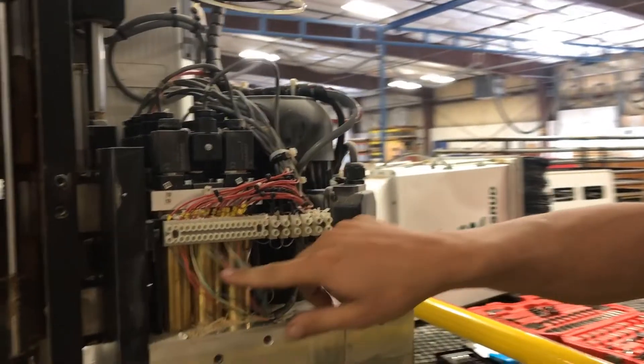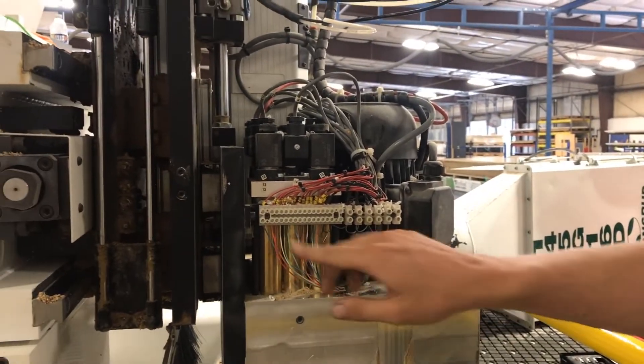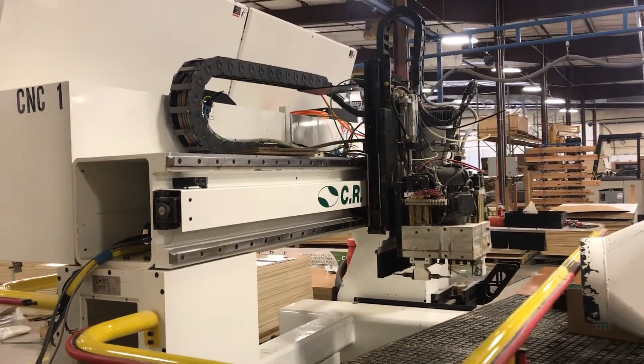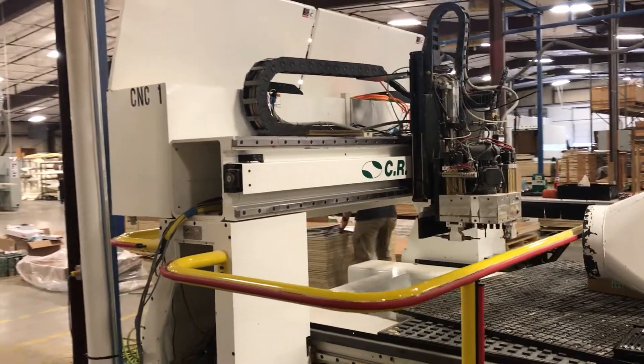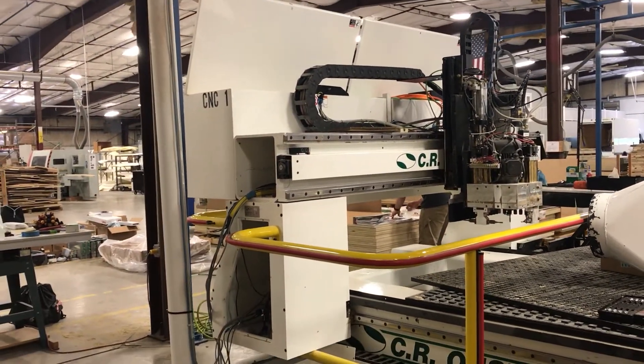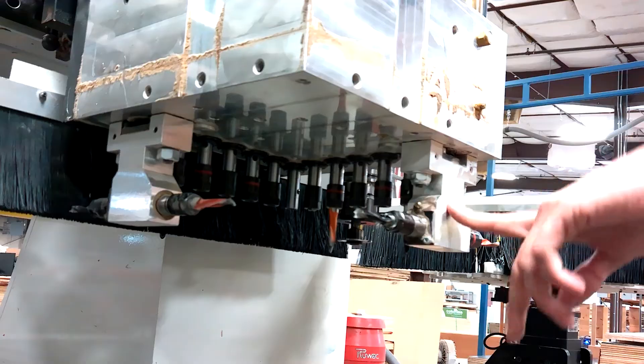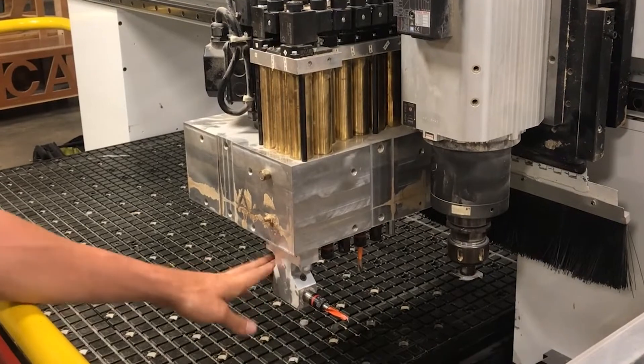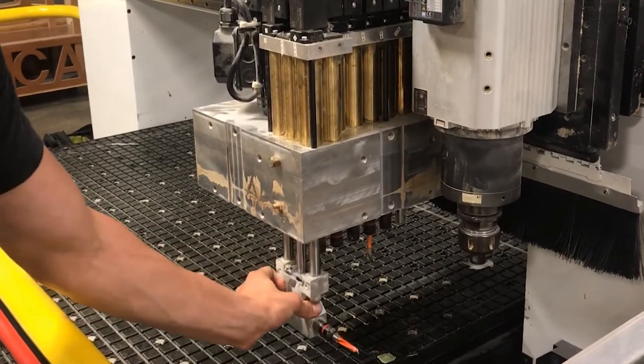We then adapt and identify all the I/O that we're going to reuse. In this case we've reused everything — backing pressure sensors, the emergency stop bumpers on this machine, so any collision will shut the machine down as a safety feature. We adapted all the old pneumatics — draw bar, drill bank — all of that was reincorporated into our control system.